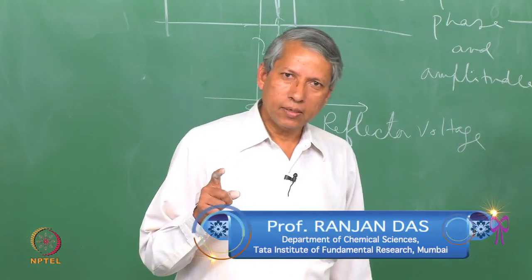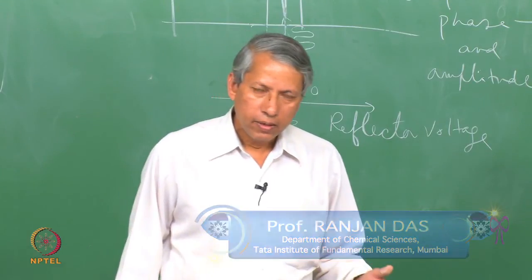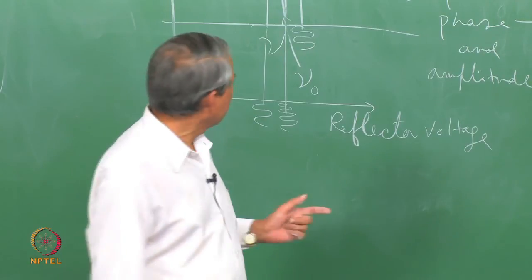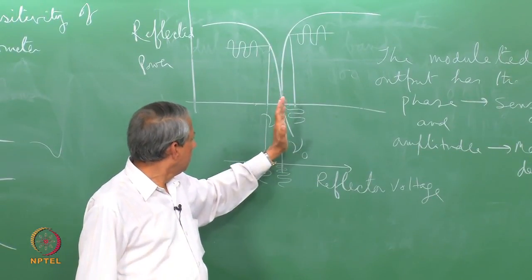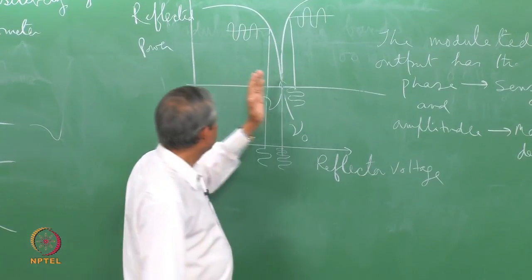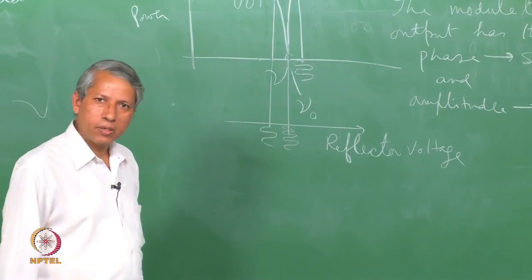The detector sees the microwave modulated by two modulation frequencies. One is the magnetic field modulated by the EPR signal, the other is the frequency modulation at the typical frequency of the AFC. Two phase sensitive detectors set to two different frequencies pick up the correct signal based on their reference frequency, and that way it can separate the signals.